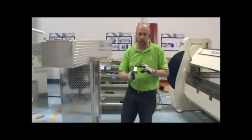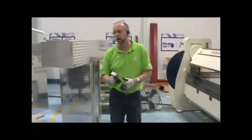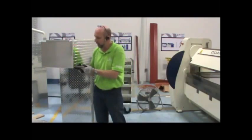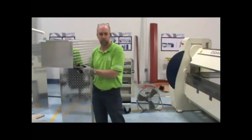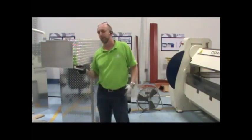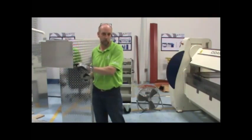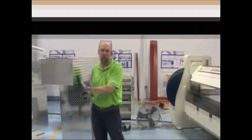One of the main advantages is in our bending tooling — it's a wide surface, so we use a tool wide enough that we span the high spots on the tread plate. This gives us more angular consistency when making the part. It also helps prevent us from scratching or putting dimples in the part like you'll get on a press brake, so that you don't distort the outside ends.